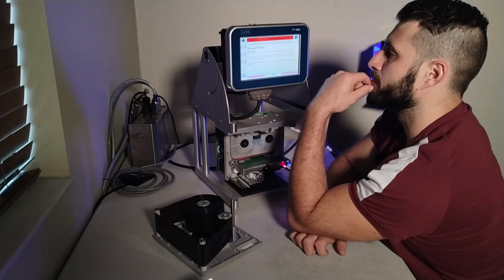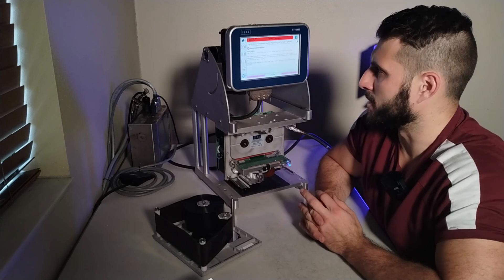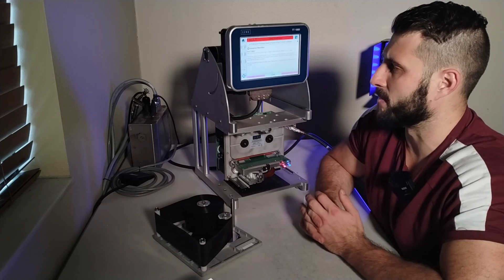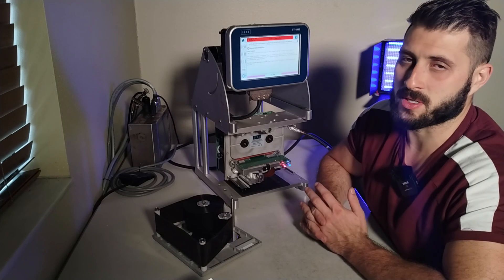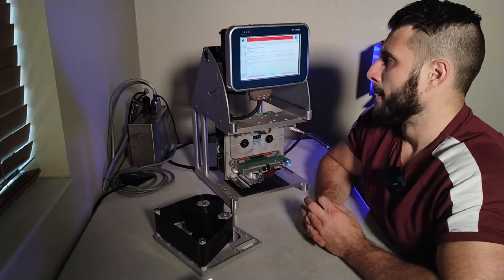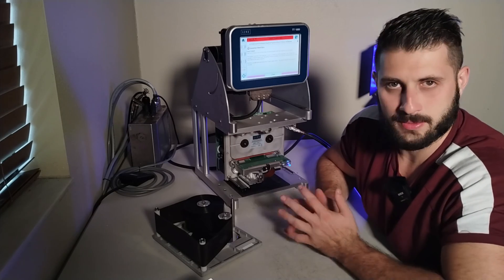So incorrect reel size — doing a little more digging. The printer supports a reel diameter of up to 110mm for normal operation, and a maximum diameter of 85 millimeters for high throughput. Also make sure you've got a core on the take-up side — we've got that.